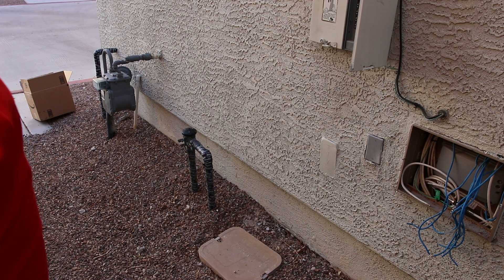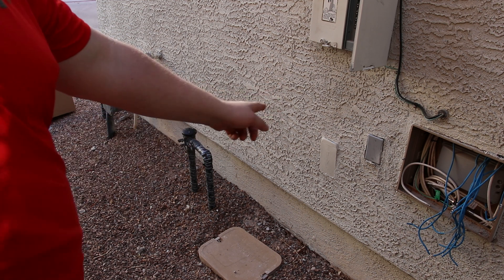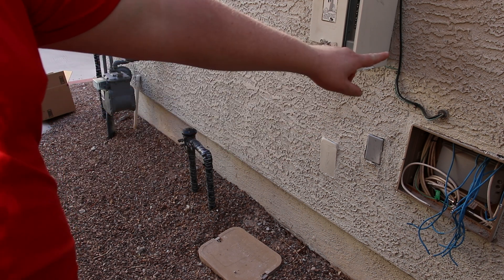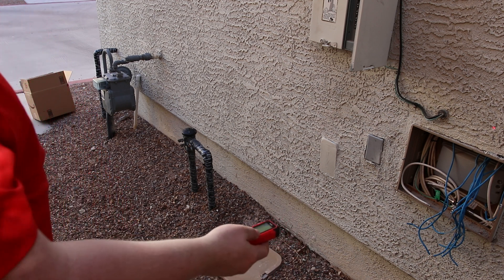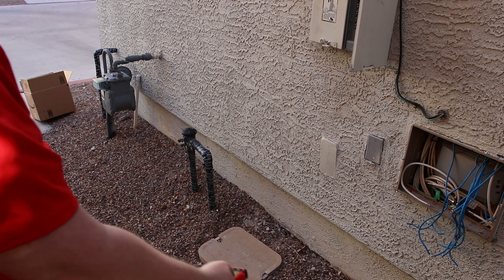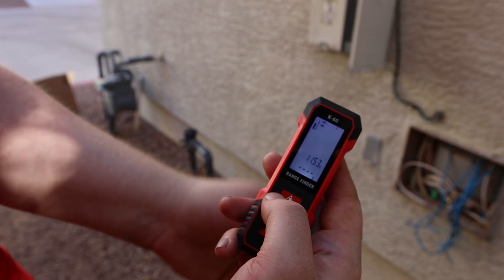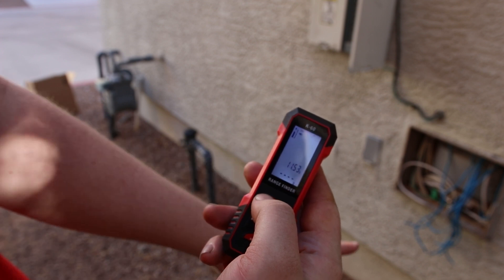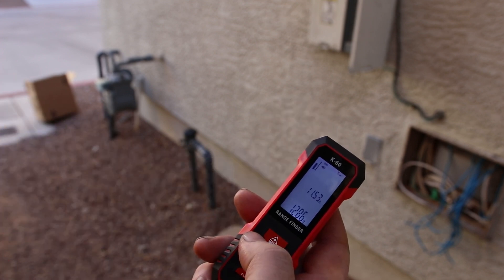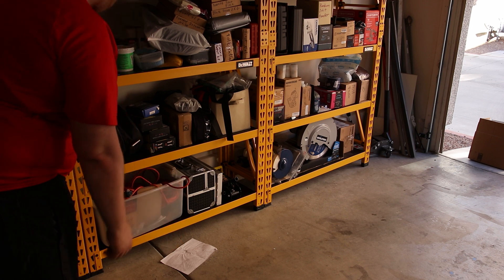I need to find the distance between here and the end of the wall so I can transfer that distance on the inside of the garage. I've got this laser rangefinder — I'm going to point it at the box at the end of the wall. It reads about 11.5 feet from the front of the box, and about 12.86 from the back, so 11.47 feet right here.